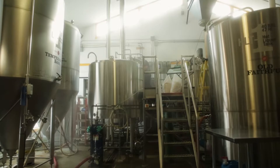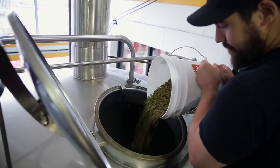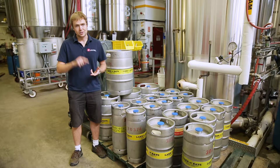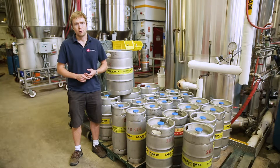One easy way that we came up with to try and remember that was the saying 'color chunks in acid.' So basically if you're standing there and trying to decide does this go down the drain or does this go to sidestream — if it's got color in it, if it has solids in it, or if it's acidic, it's got to be sidestream, and everything else can go.